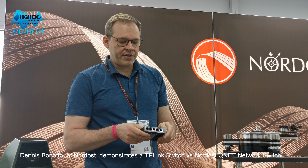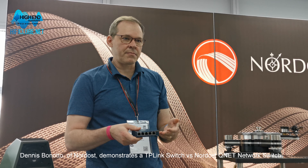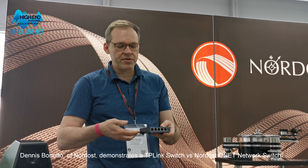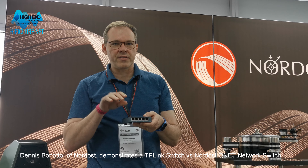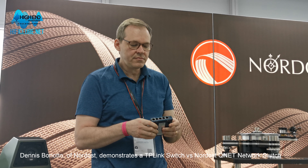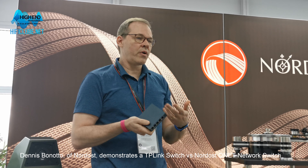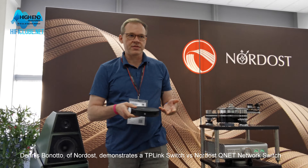That leads to some very interesting layouts. For example, some manufacturers claim they have a super high-precision, low-drift oscillator, but because they're using the same PCB, they have to mount it on a daughter board and run a cable down to the main PCB. It's a mod — it works and it's better than stock, but it's nowhere near something conceived from scratch to be an audiophile switch.